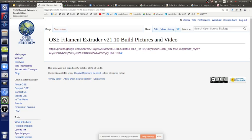Yeah, you just hook it up to the RepRap and it's working with you. You mean in Marlin or in a controller? I could either do it in Marlin or override the Arduino programming. I'm not sure, do we need Marlin doing anything, or can we just... Well, it's supposed to. We have the temperature reading and activation of the various pins, like D8, D9, D10, which we're going to use for controlling the elements. So that part is useful. But beyond that, to actually capture the data, that's an addition that could be added.